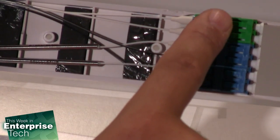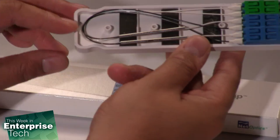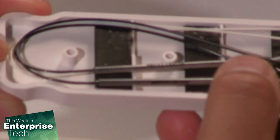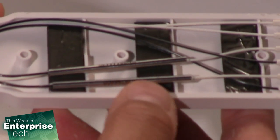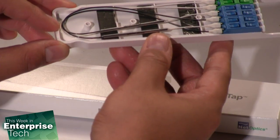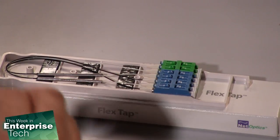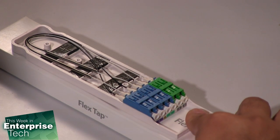The pass-through fiber is there, and this green one here is just taken off. You can see how you have one fiber in on this side, two fibers out on that side. They've just scraped away enough of the cladding and encased it in epoxy to make sure it stays in place. This is a 70-30 tap, which means 70% of the light passes through to the device it was intended for, and 30% comes out and allows you to see what's going on within the tap.